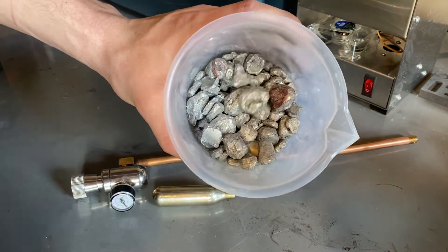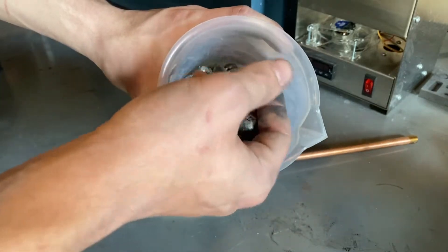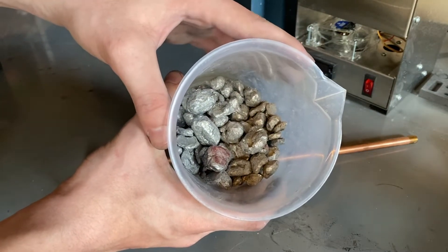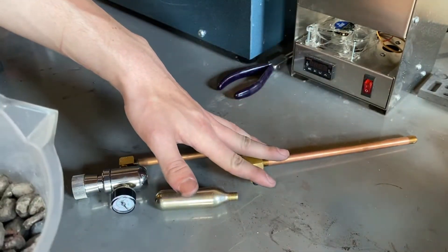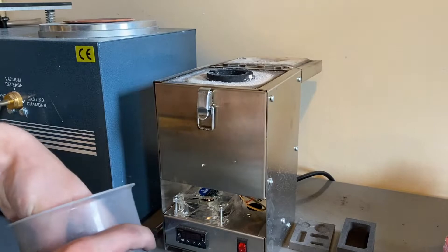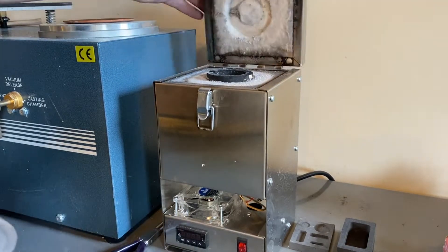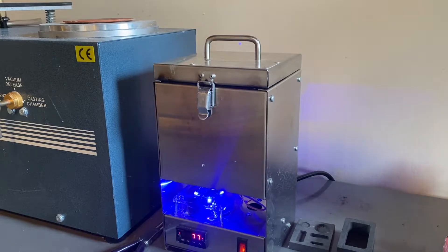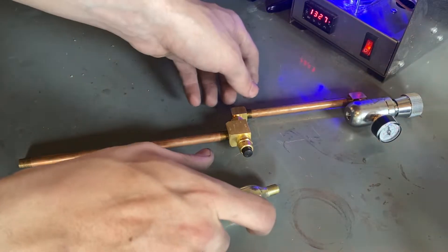I have some aluminum here — it's pretty dirty aluminum that came off of a car wheel from a scrap yard in Chicago. It has some paint and other impurities on it, and it's humid today, so there will no doubt be water introduced and hydrogen in our aluminum that we need to remove. It will be a good first test of this system. I'm going to add some aluminum into the crucible, close it up, turn on the furnace, and let it melt.